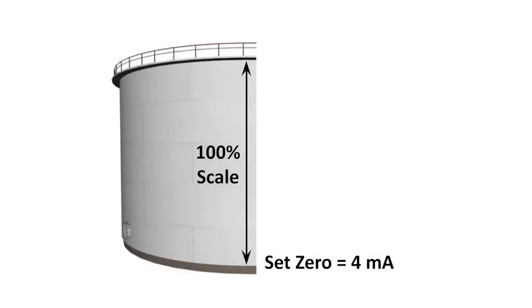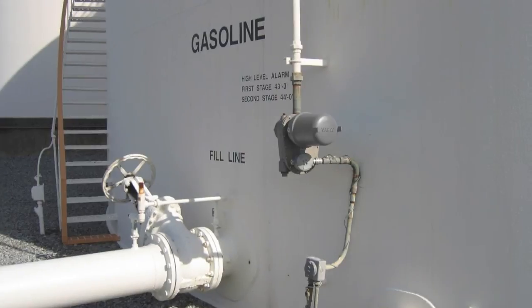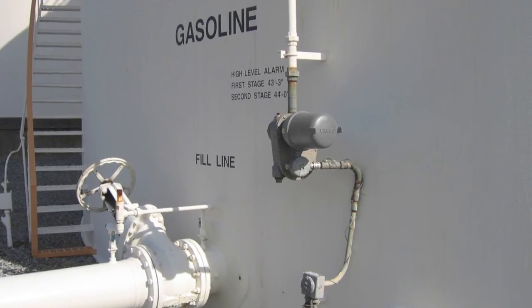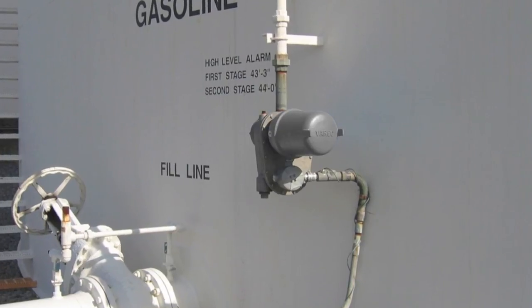Calibration for the zero and midpoint automatically calibrates the transmitter for the full range value of 20 milliamps. That's all it takes to configure the 8200. You can now install your encoder assembly into the housing and wire the unit for operation. Thank you for watching.